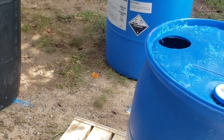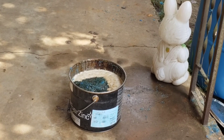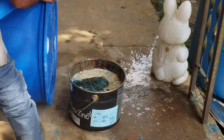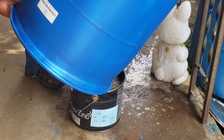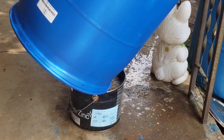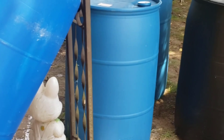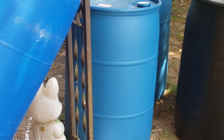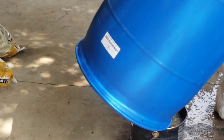After making the first two holes on the top, you can remove it and keep the rest of the chemical inside — fan it out or use something to push the liquid out. In my case it's only soap, so I can just wash it up. But sometimes it'll be oil or other hazardous stuff. Some of those barrels over there had candy or molasses — that's food, not a big deal. But if it is hazardous, let it sit 30 minutes to an hour, let everything drain out, then continue drilling or cutting.